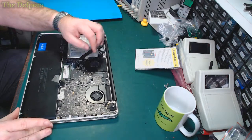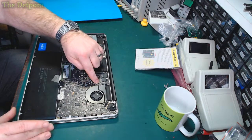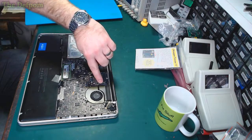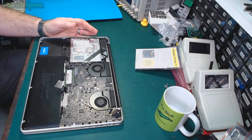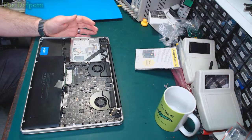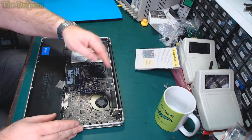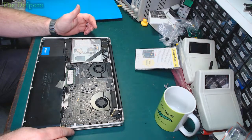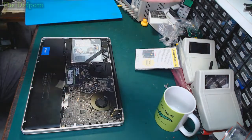is over here, by this chip up here, there's a resistor we have to disable. I'm slightly out of focus, aren't I? Of course I am. Yeah, just up here. Probably can't quite see it, but it's just there. There's a resistor we have to disable. And that kills the GPU power and helps to disable it more fully. The SPI ROM should do it in itself, but it may get confused if it can sense the GPUs there, so we disable that too. It's part of the thing that is recommended to be done. So we'll get this board out and pick up a screwdriver.